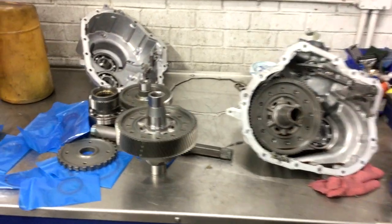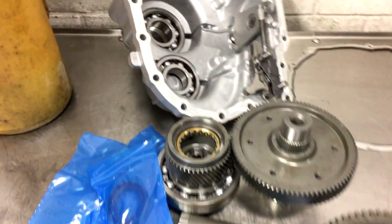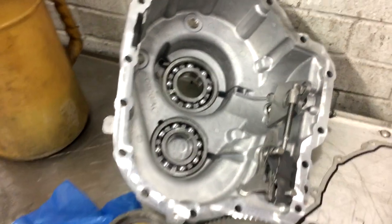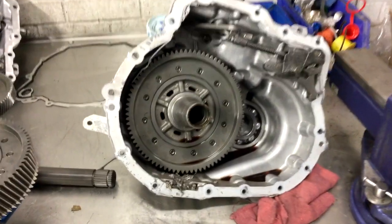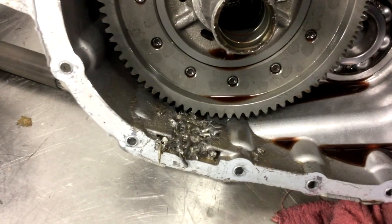Here's a look at the final drive assembly — it's all in pieces here. The new one you have to assemble; that's the new one you're looking at here. And here's the unit that failed. You can see the end of the carrier assembly that would've went into the piece on the traction motor there. It's pretty beat up, and the magnet there on the bottom is pretty much loaded.